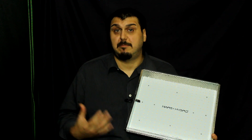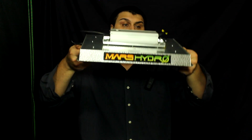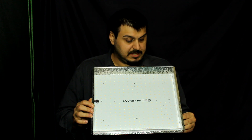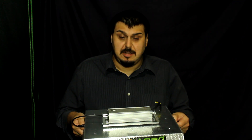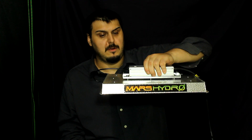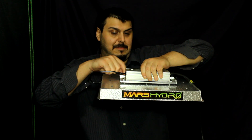The benefits of using these SMD LEDs are actually pretty awesome, because the whole light here is actually the heat sink. As you can see, it's aluminum, and basically the whole light is being used as the heat sink. It doesn't get hot enough that it's going to need any active cooling, so it's not going to need any big fans on here. The hottest part of the whole thing is going to be the individual LEDs. They have also done a pretty smart move here and put a space between the actual heat sink or frame of the light and the driver.